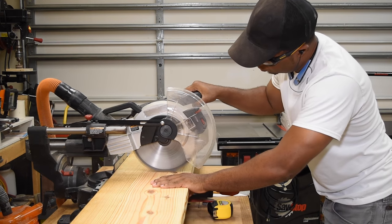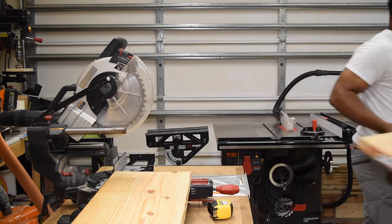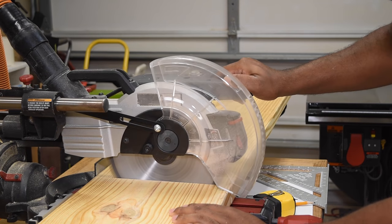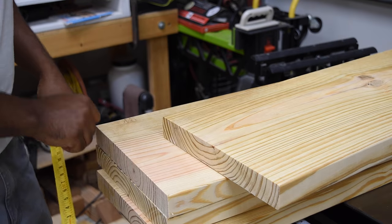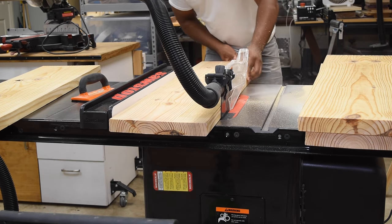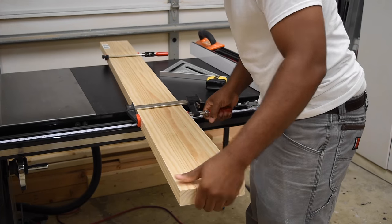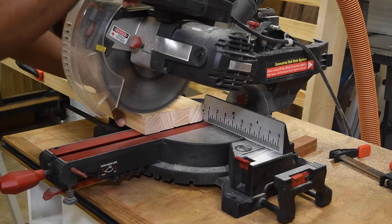Be sure to check the video description for all the materials used in this project. If rustic is not your style, you can simply switch up the materials and have more contrasting colors. I used Southern Yellow Pine for the shelves, which I then cut down to size. When using construction lumber these are never accurate, so I measured and took the size of the smallest shelf, then ripped them down to the same depth. The two standing structures are made from select pine, which I then marked and cut at the same time.